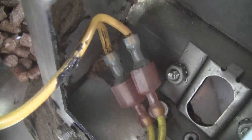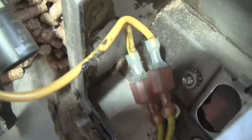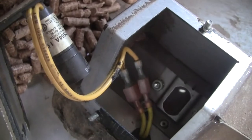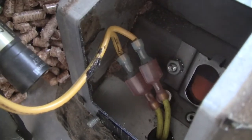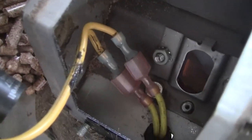The way you do it is there are two nuts — one up above and one down below. The upper one, I would highly recommend: don't take it off, just loosen it a lot. Then take the bottom one off and the whole thing slides out. The lens slides out, and that amber lens is actually two layers of material, and it gets a big smudge mark on it. If you imagine your pinky finger with some soot on it touching a piece of glass, that's what would happen, except it's super thick.